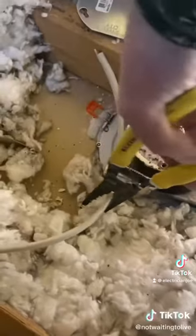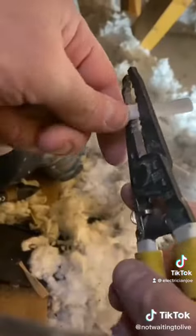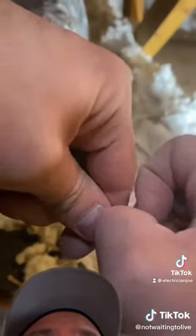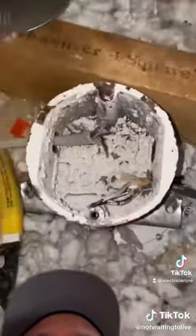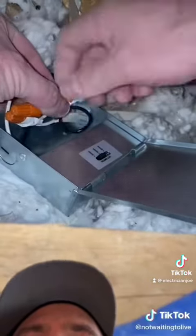He's got his wires stripped and is cutting. Another thing to make sure of: you need six inches of wire measured from the back of the box. This is so that you can make changes easily. Same thing here — that needs to be six inches of wire.